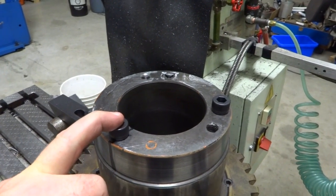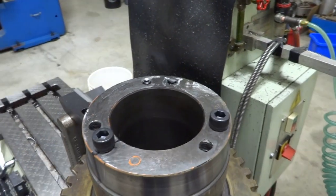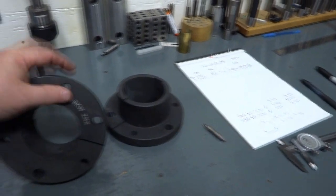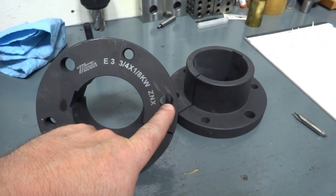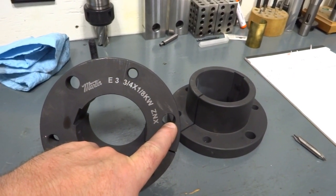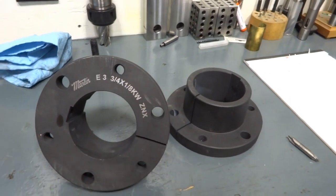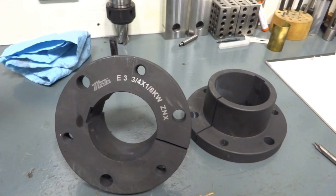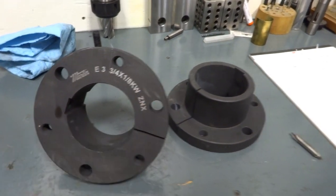All this error together may put these two bolts out of position relative to the threaded holes by two, three, maybe four or five thou at most. The taper lock bolt hole is 570 thou in diameter, so there's 70 thou clearance — meaning the bolt hole could be 35 thou out of position and the bolt would still go in. The worst case for me is about five thou, which is one-seventh of what would probably be acceptable. So I'm pretty happy with this setup.